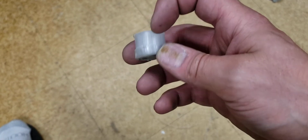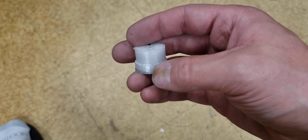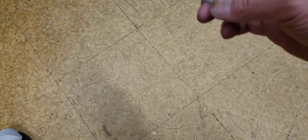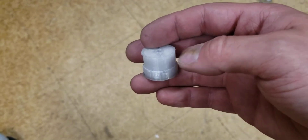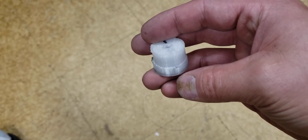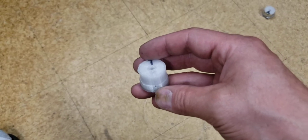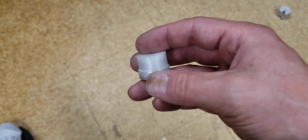You want to hide the mark inside the spool, so when you lace it through and come out the other side, just put the black mark inside the spool before you begin winding it. When you install the cable, I'm installing it short side down on both spools. When you go to wind them, the short side will be on the bottom.